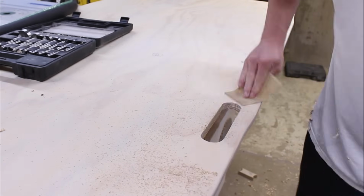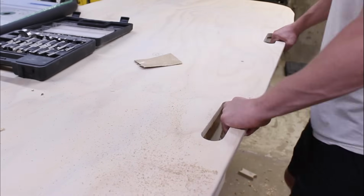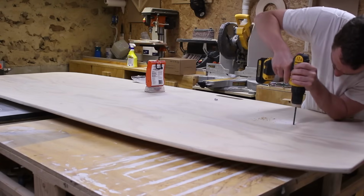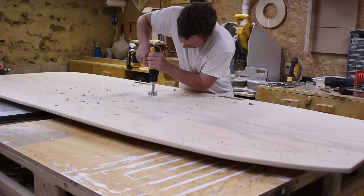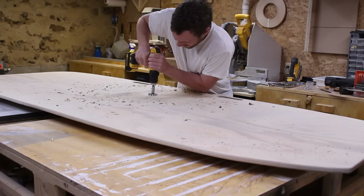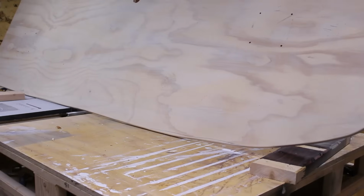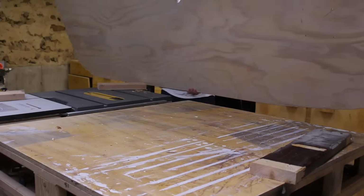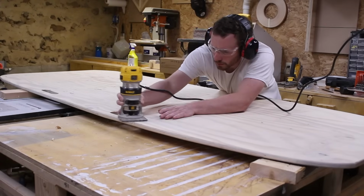This also ensures that I have the most stable and secure floor as possible. I drilled out 4 holes for where each seat will be, as well as a 2-inch hole where the motor mount cable will fit through to attach the cable to my battery. On the underside of the floor, I used my router with a roundover bit to make the edges smooth on the carrying handles as well as the hole for the cable to eliminate any sharp corners.